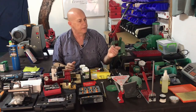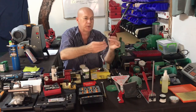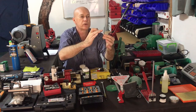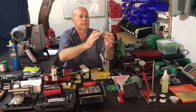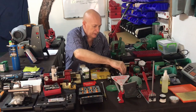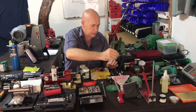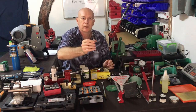There's one specific deburring tool that I like a lot — the Redding one. You'll see the difference between the two: this one has a shaft in the middle that protrudes through the flash hole and centers the cutting edges on the deburring side quite nicely. There's also a nice VLD deburring tool that I use. These are flash hole uniforming tools.